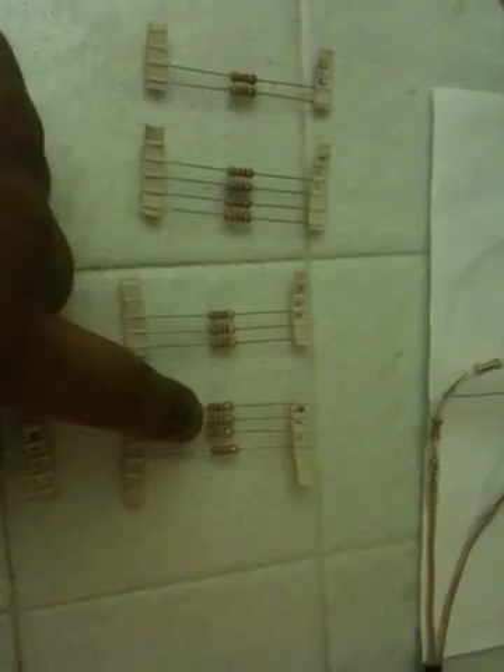After putting the first version together, I realized I didn't probably need as many resistors. So I used one 2.2, one 1.0, one 0.46, and then two 0.1s — which is 0.2 — giving me the higher rating. The resistance went up after soldering, so I decided to replace the two 0.1s with a single 0.15, combining 2.2, 1.0, 0.46, and 0.15 together.